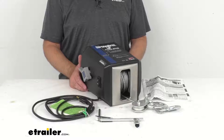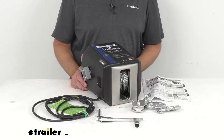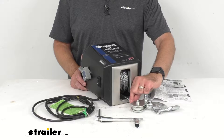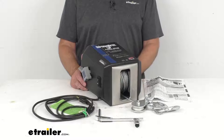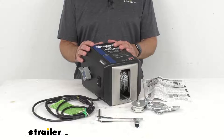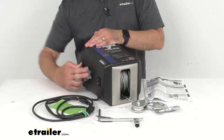The brushed stainless steel front plate offers superior rust resistance, and this winch is made in the USA. The current draw is six amps at 120 volts. It's important to note that electric winches should be used intermittently — maximum continuous runtime is four minutes. The gear ratio is 570 to 1, the cable is 50 feet long with a diameter of 7/32 of an inch, and the load speed with no load on a full reel is 9 feet per minute, and at full load on a full reel is 4 feet per minute.